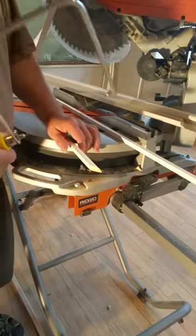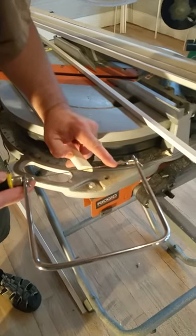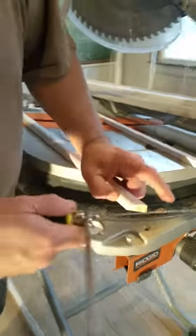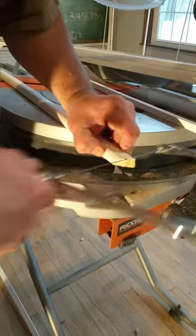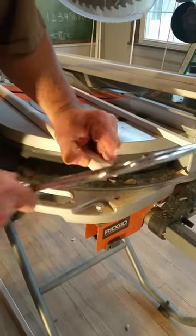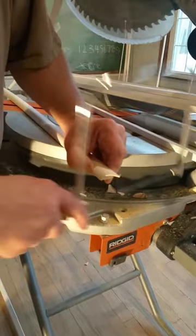I'm going to take this point right here with it laying on my tabletop, using my finger just to place the blade right below the tip. We're going to cut this area out along this line right here. I draw the blade back, take it really easy, and just go right along the edge of that curve. It doesn't have to be perfect because I'll show you how we're going to fix it once we finish cutting. I'm turning the blade to try to match that curve.